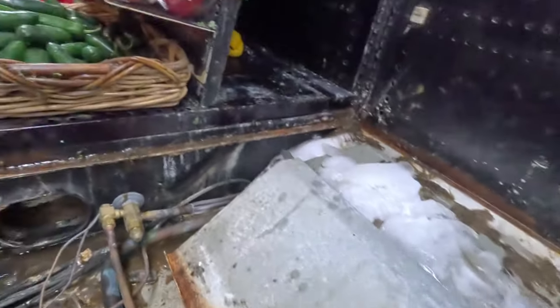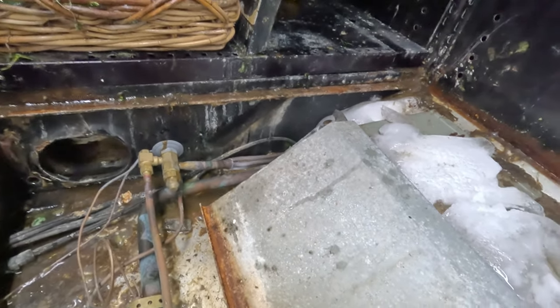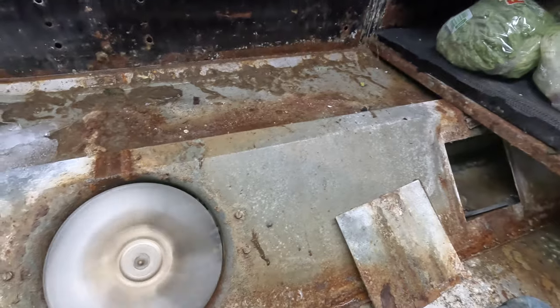You don't see a lot of ice right here — it's hard to see much because we've still got to dig half this case out. But there's a good chance we've got a restriction here in our screen on front of the TXV. So I'm going to check on down the coil, but if the other ones aren't like that and this one is, it's more likely something to do with the screen first. If it ain't the screen, we'll go on to the next step. You can see frost big time right there, which ain't too uncommon. It's looking like we might have a screen that's gunked up.